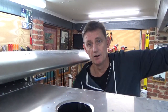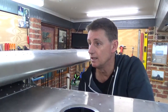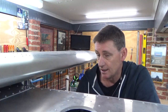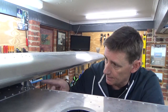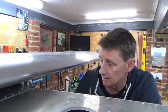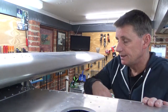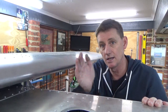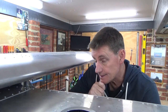Alright, so working up on the bench. One important tip — if you hit your head on the rafters, it's going to hurt. Getting up and down on this bench about 10 or 15 times. I've probably put the tailplane on at least a dozen times by now — just lifting it up, make some adjustments. I've just shimmed each side about 15 thou each side. About to measure up just to get the angle this way, so it's parallel with the wing — which aren't installed yet, but it's parallel with the fuselage. Incidence is fine. Time to drill it, I think.